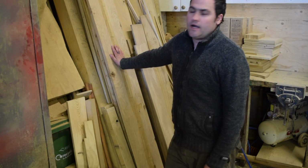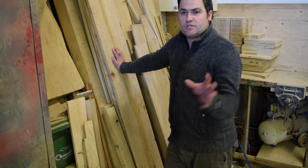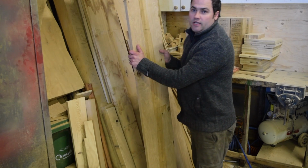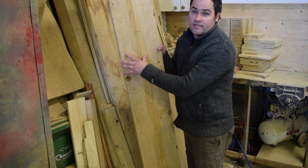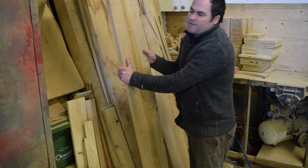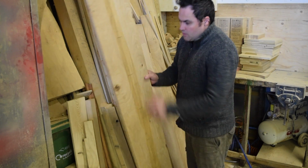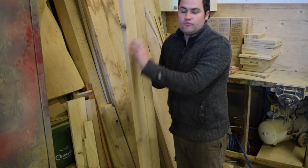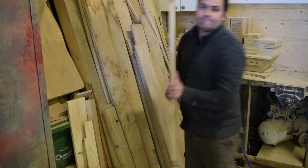For a wedding crate. It's a solid oak crate, which is going to have some bespoke laser engraving on the face of it. So, luckily we've got a couple of panels already glued up, biscuited and glued up. You've seen us do that before in previous videos. So, what we'll do is we'll go ahead, we'll cut this to size, we'll cut the rebates in it on the router table, and we'll go and engrave it.